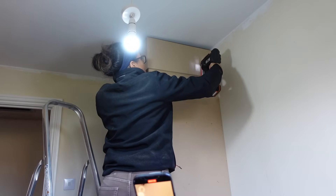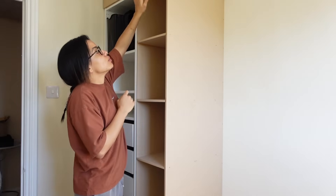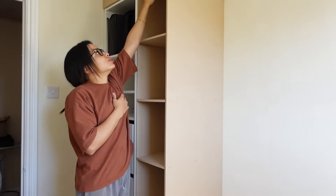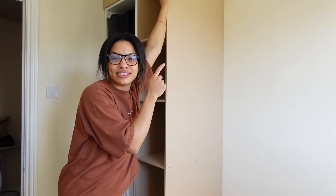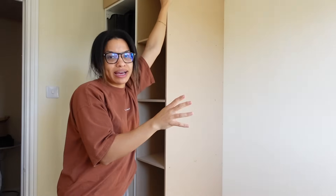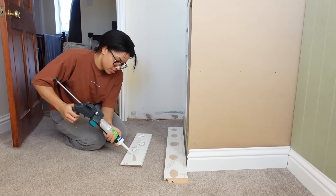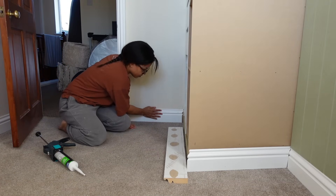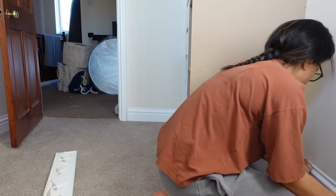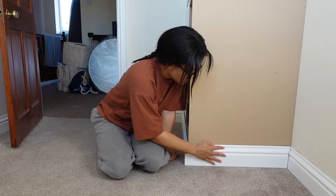It's been a couple of days and we have got the wardrobe and the shelves made and screwed in place. I've also done a pelmet-style topper on top of them to seal it all off. The reason I did that was because I measured one side wrong, so instead of trying to fit a new piece of MDF up to the top and smooth it all out, I decided to just frame it out instead. I also cut down our existing skirting board and managed to reuse and salvage it, which is really good. There's a tiny little space with a slightly bigger gap because of the width of my mitre blade — it takes a little bit off with each cut — but it looks really good where you can see it, and it saves me 30 pounds.